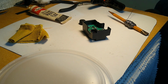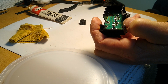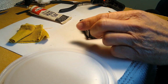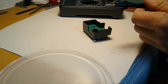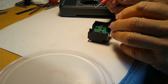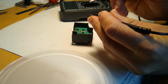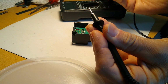Really got to inspect it. I think we got it well. You can see the shine now associated with those two terminals up here in this upper corner. You can see that we got solder on there. It's good and hot. It should be a good connection. We'll again look for continuity here and see if it seems to have improved any. And this will make an audible sound when there's continuity.